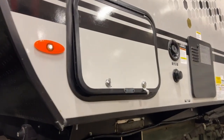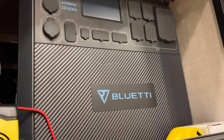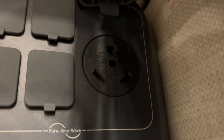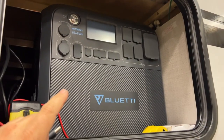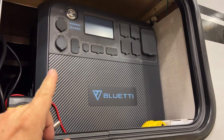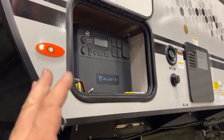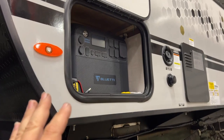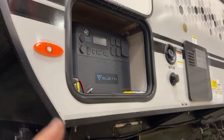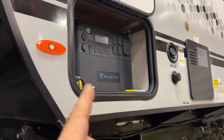It will be hot this weekend and I'm planning on not taking a generator with me. So I've stuck my Bluetti AC200 Max in here. This has a 30 amp plug — the same plug that the camper uses. So if I want to run my air conditioning I can just plug it into here, turn my air conditioning on. And I can also recharge this off of the solar panels on the roof. Because this fits so well into my storage unit, this let me fix all of my electrical needs very quickly. All I had to do was add my solar panels on the roof so I have a way of charging this during the day. And now I have an inverter powerful enough to run my air conditioning, as well as its own built-in battery.